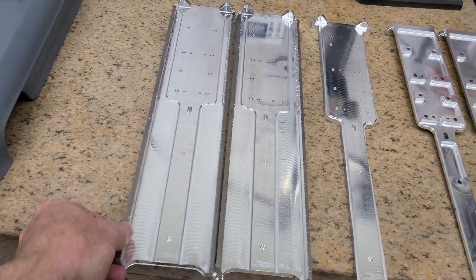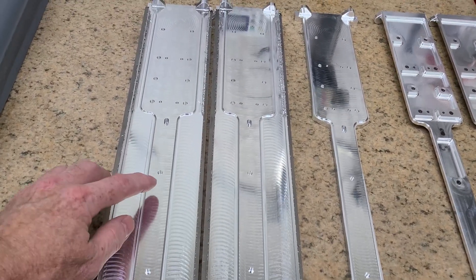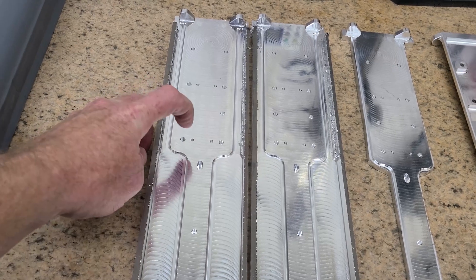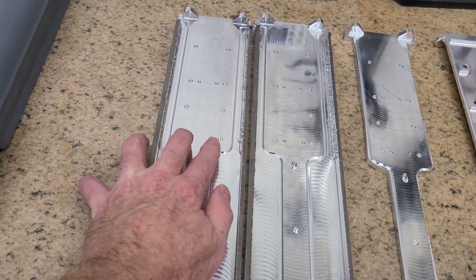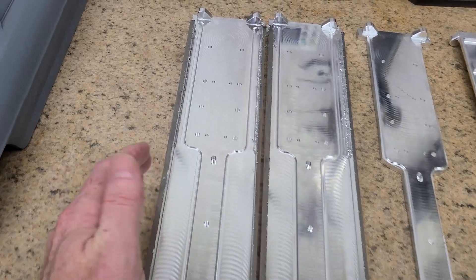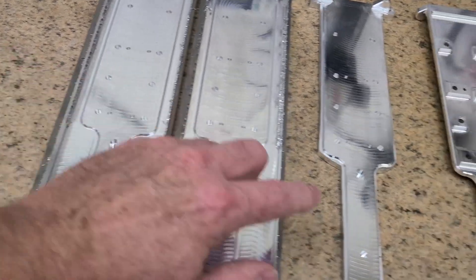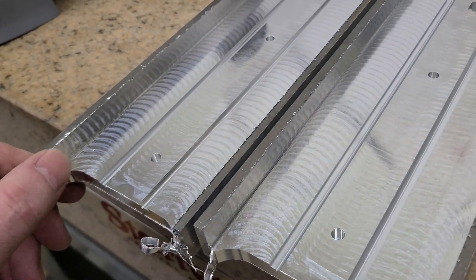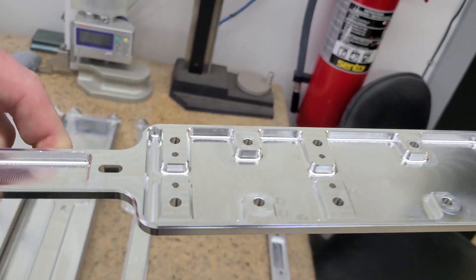Basically, we just took a chunk of stock and did op one in this side. Cut all the holes with a 1/8 inch end mill, and these are 1/8 inch slip fit dowels. I just took the end mill and drilled with it — perfect fit. Everything else I just opened up their screw clearances. Using these dowel holes in a fixture for when I flip — and that's the back side. Front side: I come in here and do a bevel right there, that's a little edge break for the finished part, and then I cut out that trough on the bandsaw, because you can't have this lip right here sticking up. So we cut that out, then flip, and do all this work. And here you can see all the work that has to go into this side.